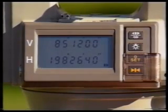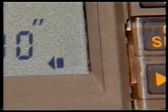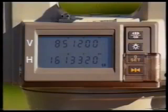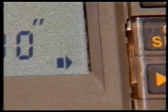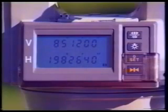If an anti-clockwise horizontal circle graduation is required, it is obtained in this particular instrument by simply pressing the dual function key. The arrow on the screen then changes to show the new direction, and the horizontal circle reading alters to 360 degrees minus the clockwise value. A further press of the same key restores the clockwise graduation, and the screen arrow and the horizontal circle reading again change.